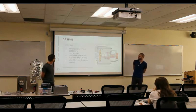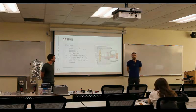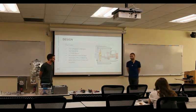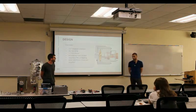This is our final IPA pump design, which didn't work for a number of reasons we'll get into. The optimized pump specs were a three-inch impeller diameter rotating at about 36,000 RPM with 1.7 kilowatts of power. We selected a Flowserve mechanical seal, which is a bellows-style seal — what the last capstone team used. It worked just okay for them and a little less than okay for us. We also used a stainless steel axial thrust bearing, which in initial IPA pump tests didn't work too well, but we used it in conjunction with another bearing in the cryo pump and that went pretty well.